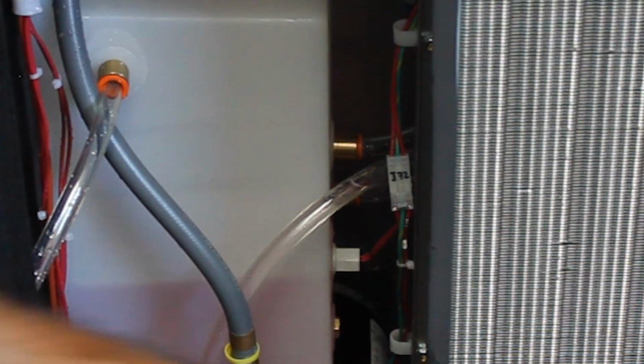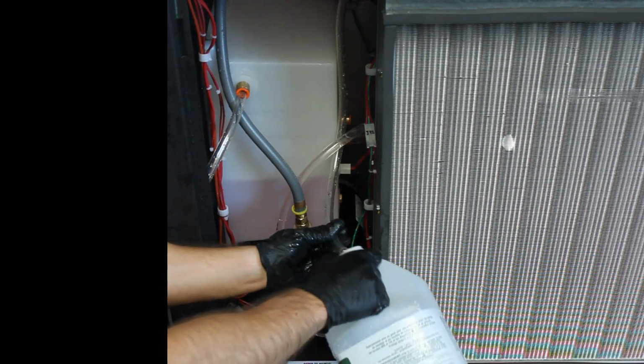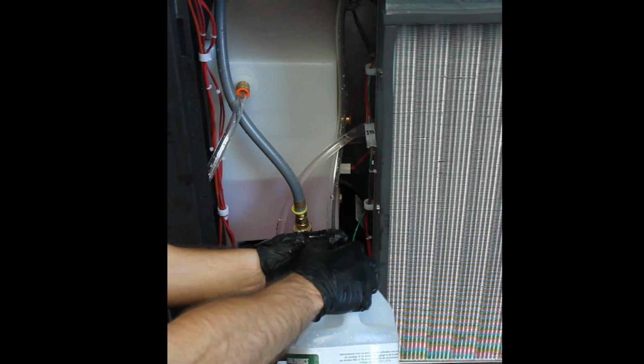You will need to locate the return hose that connects behind the pump to the coolant tank. Prepare a large enough container, example an empty coolant jug. Make sure the container is empty and clean. This is where you will drain the coolant into.